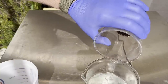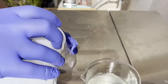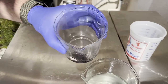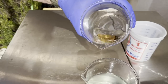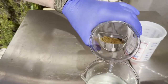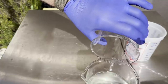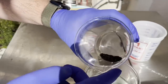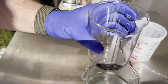If you recall, we soaked it in hydrochloric acid before we even dissolved it the first time. So that gold was looking pretty good before we even dissolved it. We got a lot of those base metals off. Let that settle. Alright, now we're going to take this container. We're going to take this gold and we're going to put it on a hydrochloric acid boil for, I don't know, a couple hours. Be back with you when I do that.